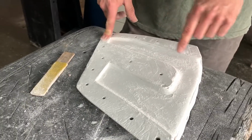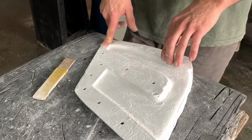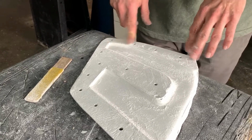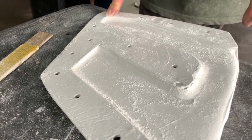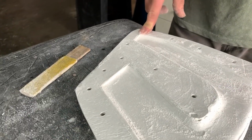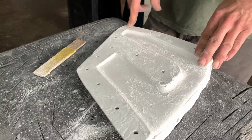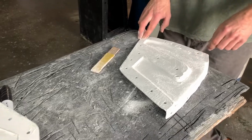Cool. And so what you're about to do is, these are the molds. You're just trying to file them down and get them ready, I guess. Correct. We're just getting rid of rough edges, and then we're going to fill in any small voids, then wax them up with mold release and start bagging them up with carbon. Awesome. All right. Well, we'll get to a little bit of time lapse.